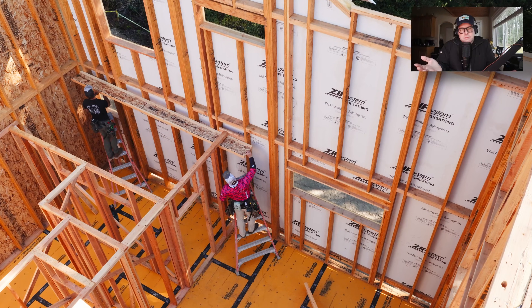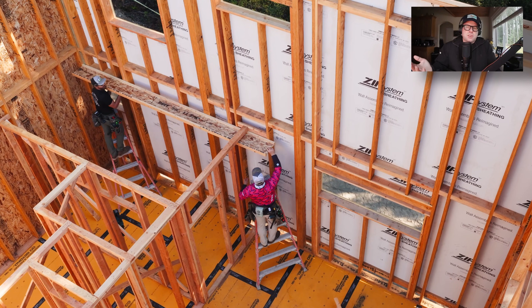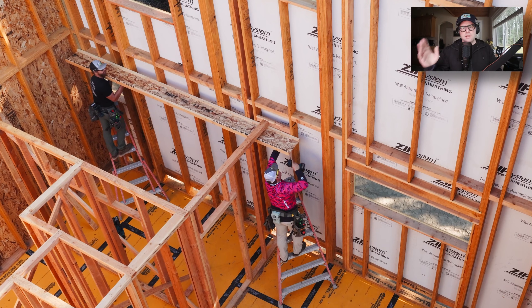Here is a tip. Every once in a while we do something that convinces us we're smart enough to keep doing what we're doing — we have one win for every 99 whiffs. Years ago, old Kyle and me got in the habit of using boneyard I-joists — whatever the lumber yard had, we could buy them dirt cheap. We'd use them for racks: if we had squirrely two-by-twelve rafters, we'd screw it to the underside, plane it all out till the roof was on, then either leave it or take it off. We'd also use them to brace forms. Pretty genius.